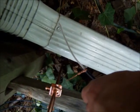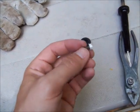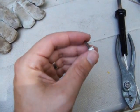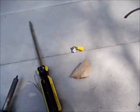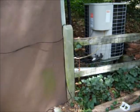Also make sure to get some sandpaper or a file and really clean up the sheet metal screw, or use a new one. I can't zoom in, the resolution is not great on this camera, but this is pretty shiny at the base. Also scrape up a little bit on the gutter itself, and then this will just attach to the other end of the coax. That's the outside connections all tucked in.